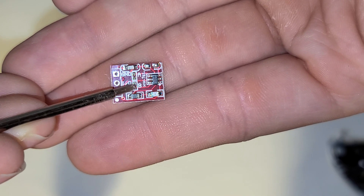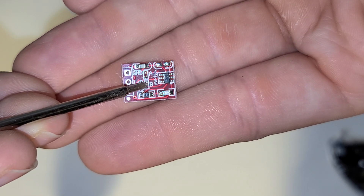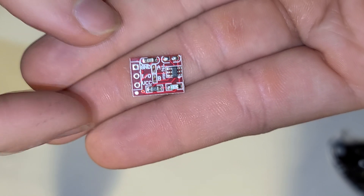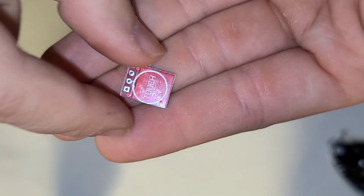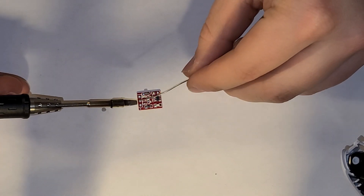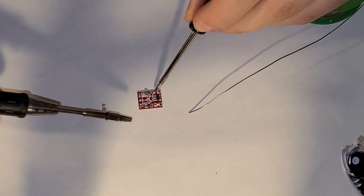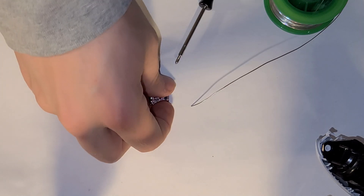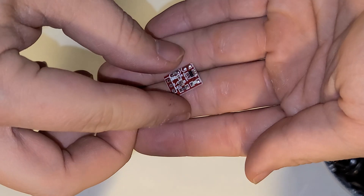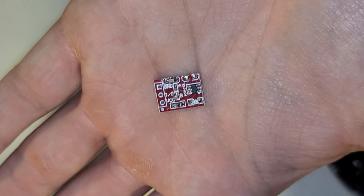The mode I want activated is to simply be able to touch the touch sensitive button through the controller to turn off the LEDs, and if I want to turn them back on I just touch that same area again. To activate that mode we have to bridge the two connections on solder point B. As you can see there are two little tiny solder points — we just put a little bit of solder onto our soldering iron tip and then touch it directly to point B, and that bridges those two connections and activates the mode.